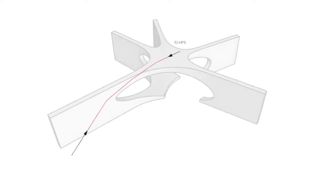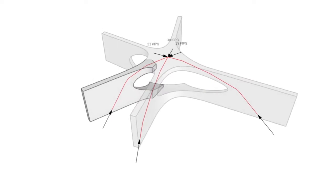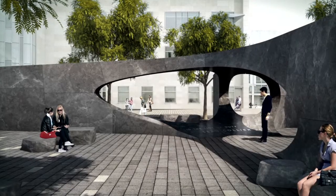What we really have are 5 half arches, which are each leaning in toward the middle. And while that half arch should fall over, there's another half arch somewhere else leaning in, and another half arch and another half arch. So each of these are coming together and balancing perfectly in the middle. So the arch is exerting an outward force, and the walls, the 5 radiating walls, are buttressing the central part of a very flat vault.